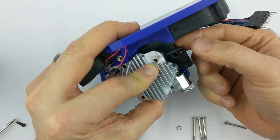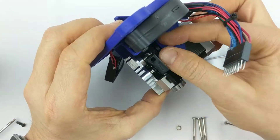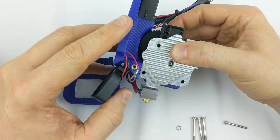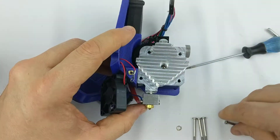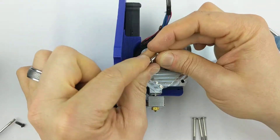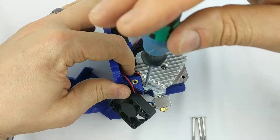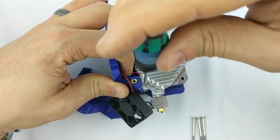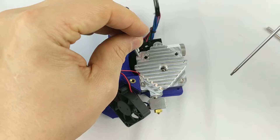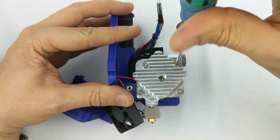If it's not closing completely, usually it means the hob bolt shaft isn't sitting in its bearing. Giving the hob bolt a little wiggle back and forth will let the shaft seat into its bearing. Then reverse the process to install everything back. I usually start by putting the screw through the eyelet and putting the star washer on. Remember the short screw threads into an insert in the plastic, so it just needs to be snug — you don't want to tighten it too much or it'll crack that insert. The other three long screws thread all the way through into the stepper and can use a little more force.